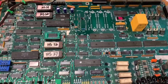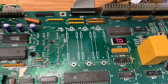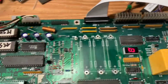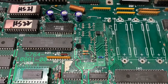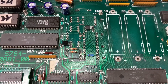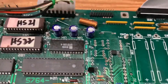First test of the high-speed CPU that I was abating alkaline damage on, and it boots to 0 on the display. It looks like an 8 but it is in fact a 0. I have replaced the reset section with a modern reset generator, and this is the minimum required configuration for installing the reset generator.